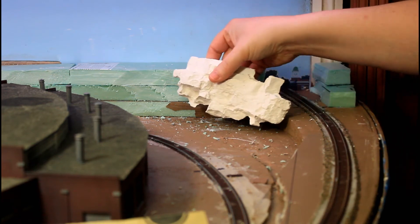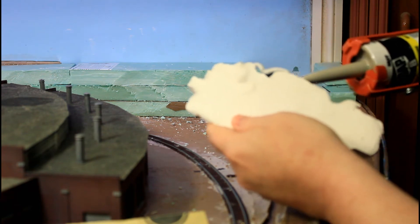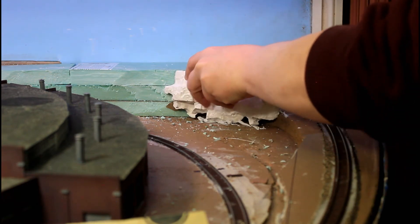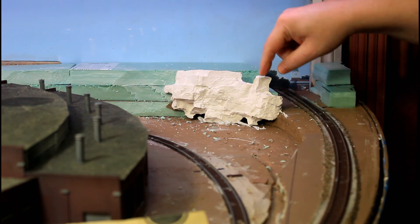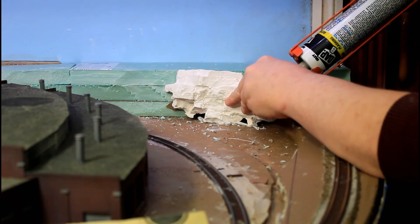Let's get our rock face put in back here. Starting at this end, I'm going to start with the first casting — I've already cut these down to fit. All I'm gonna do is put a little caulk on the bottom. I'm using the same 230 caulk that we used for the foam. The only thing I want to take care not to do is get the caulk on the face of the rocks. The back is fine and everywhere else around is fine, but you don't want it on the face if at all possible.